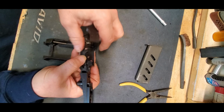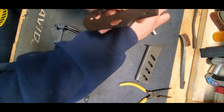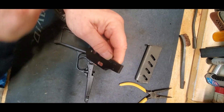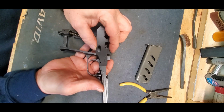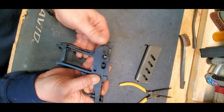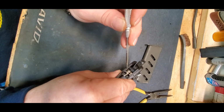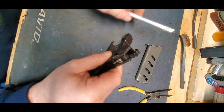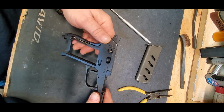And there is, see this, if you look on the side cover, right here, there's a lip right there. This is why we don't pry on the front by the trigger to get this off. Okay? To put this back on, that lip goes in first, like that. And then the gun goes back together. Side cover goes back on. And the hardest part of this, see that pin right there? The sear pin? You got to get that back in the hole. So you got to maneuver it around. And then it just snaps back in. No worries.